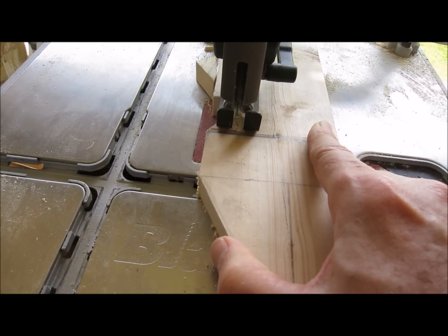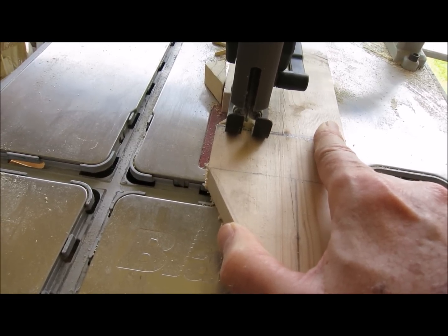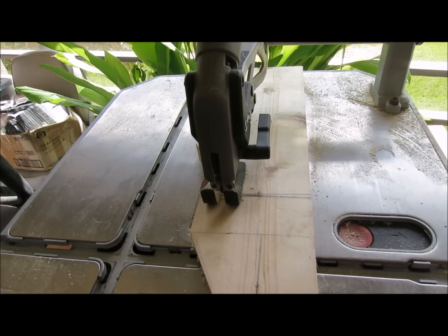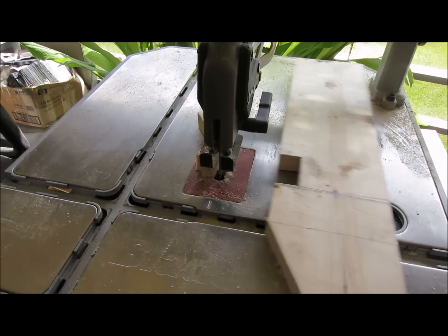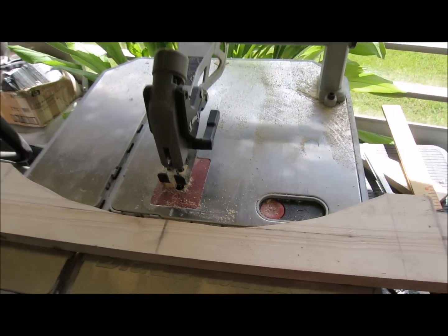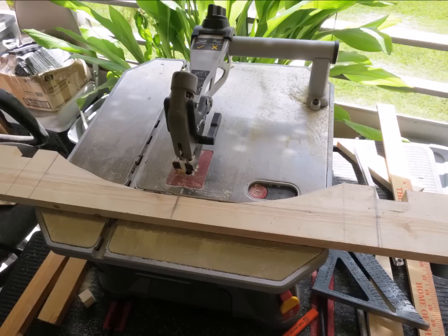And the feet I just made out of scrap 1x2, and I used some stainless screws. Anytime you're going to be messing around with salt water or even fresh water, if you're going to have screws and bolts and nuts, you want to use stainless whenever you can. It's not worth the price of messing with the other stuff. You're going to get rust pretty soon.